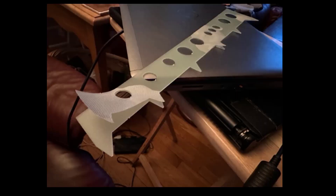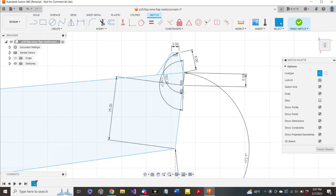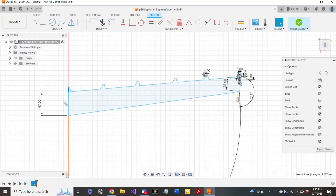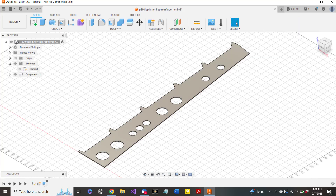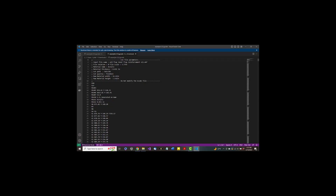As you can see in the film, we are pretty happy with the water jet, but we are disappointed that it can't cut laminated fiberglass panels. We are RC plane hobbyists and that is an important material due to its high strength and light weight. In this case, we decided there was no harm in re-laminating the flap reinforcements you saw us cut. If it was a more critical piece, we would probably think twice about that. I suspect the same problem would occur with carbon fiber panels — I will test that sometime. The water jet should be good for carbon fiber because it eliminates the dust and smell problem that makes working with carbon fiber difficult. I hope you found this video informative. I will see you next time.